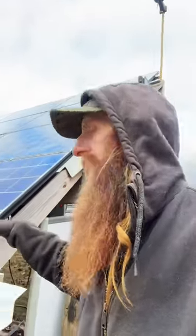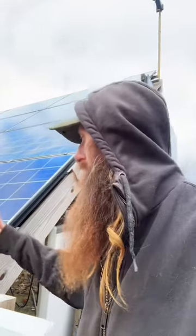I learned that these panels had bypass diodes in them by the fact that I went to work on the system when I was installing it, and I said, oh, I need to cut the power from the panel so I don't electrocute myself. So I covered a small portion of it with a piece of cardboard, and before I touched all the wires, I tested it. I still had the same power input as I did before — the panel was bypassing that area, allowing the other cells to continue to produce power.